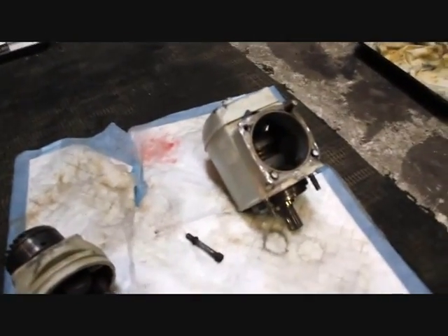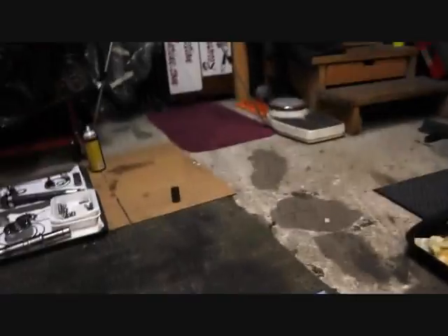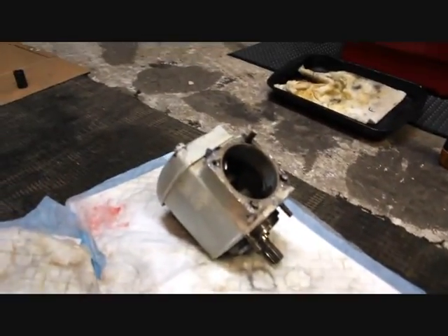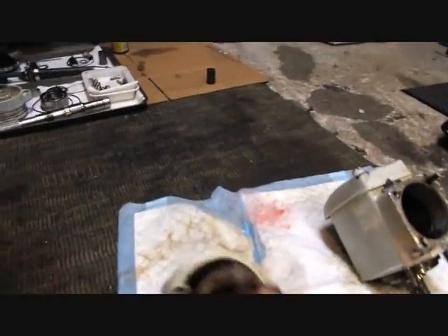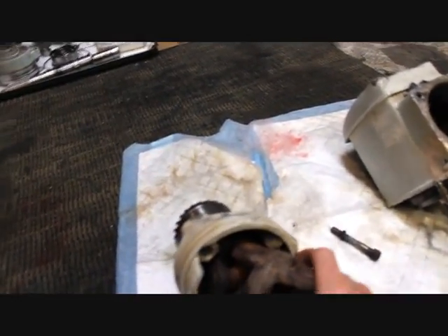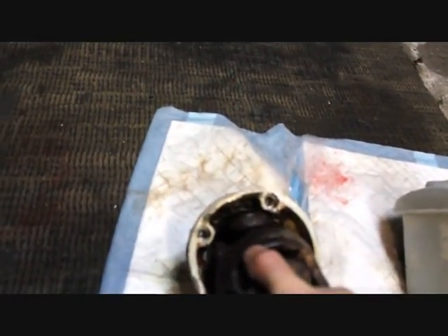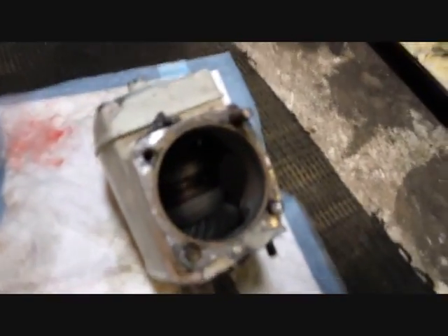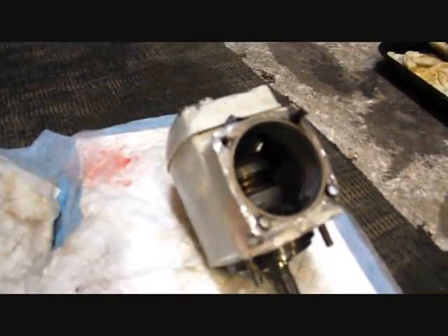We have our pieces apart finally — four days I believe. A massive amount of hammers and chisels and anything else, cut-off discs. But I need to correct something first off. When I said earlier in the videos that we drilled these out, it actually meant that I had drilled out the heads about three-eighths of an inch down into the actual holes themselves. They did move but apparently they weren't coming out. So we now have three that need to be removed — and that's not good.